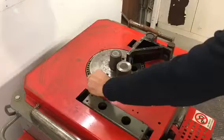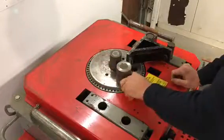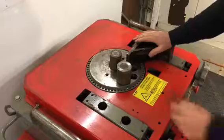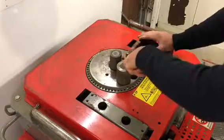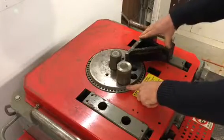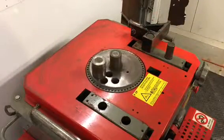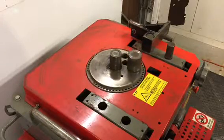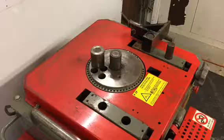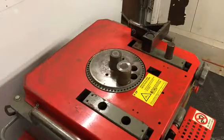Moving the pin into that position — if you want to bend less, move it closer to the limit switch, or further away for more bend. Be aware that the table can rotate 360 degrees without the pin, and it can collide with the arm, so always make sure you've got the pin in or the arm flipped back. If you take the pin out, the table will just keep rotating. If you stop in the wrong position and want to go back to the home position, there's a button on the back here called reset — press it and the machine will go back to the home position.